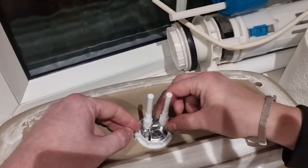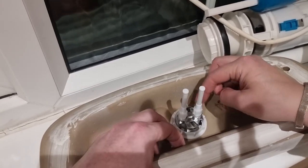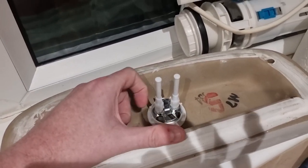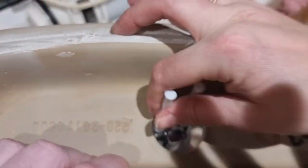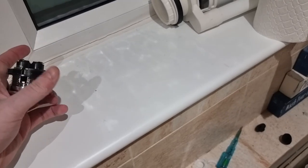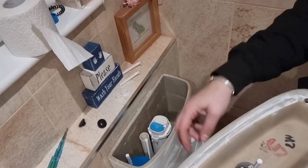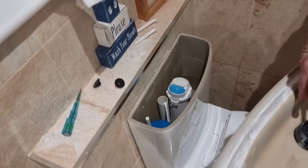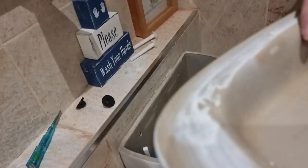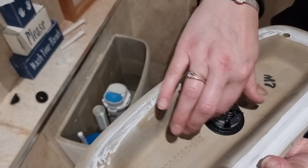At this time, you can look at the push buttons, which is really straightforward. On your old push button section, there'll be a swivel. Simply push it clockwise, it'll be anti-clockwise to unscrew. Unscrew the old one. Once it's unscrewed, it will simply pop through, like so. You can then simply get the new one, unscrew this, and replace it into the same hole as the previous one, like so, before refixing the top, refixing this in place, which can be done in seconds.